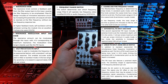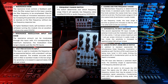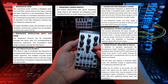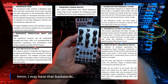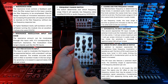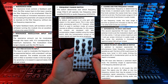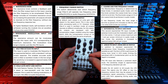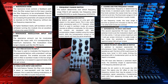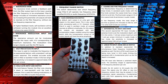There's also an AC switch on this side. The AC switch will reject any DC offset at low frequencies, and I believe this is to help keep things clean when oscillating — if it's down it allows DC, if up it's AC only. Two other switches are comp on the left for gain compensation, which normalizes the eight phased outputs, and hold on the right, which is used in LFO mode to freeze the current positions of the eight outputs. This can also be controlled via CV gate for interesting results.